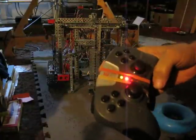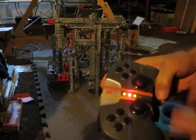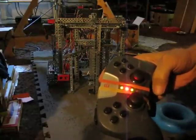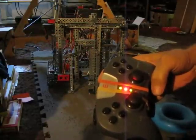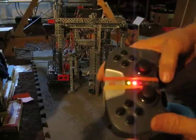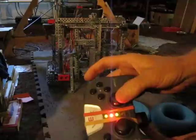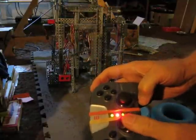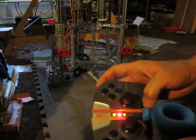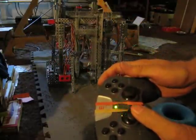Normally, when you have a joystick like this, there's usually two required — one for an operator to handle the driving, another for the operator to manipulate the lifts, etc. You can break it down to a one-operator job if you use automation. The controls are pretty simple: we have arcade driving and there's only one lift command, which will automatically transfer a lift input to the proper set of slides based on the limit switch activation.